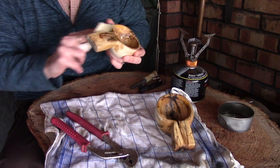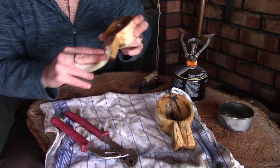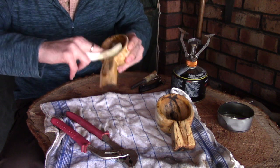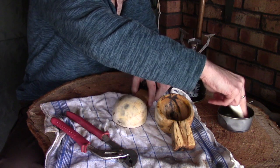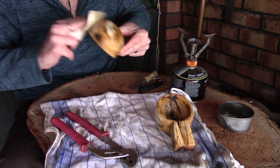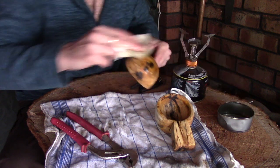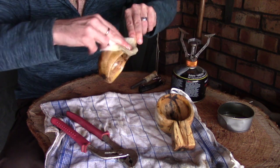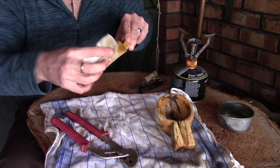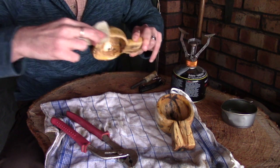The heated oil will start penetrating into the wood and basically start protecting it. The benefit of this is once you've given it a couple of coats, it will require a little buff off with another clean cloth, and you'll get a fairly nice, almost shiny finish — not quite as shiny as a wax coating, but it will give you just as much protection. As I said, I'm not wax coating this because it's for a couple of fairly young children, and a wax coating that's not handled carefully will just mark and make them look quite untidy.